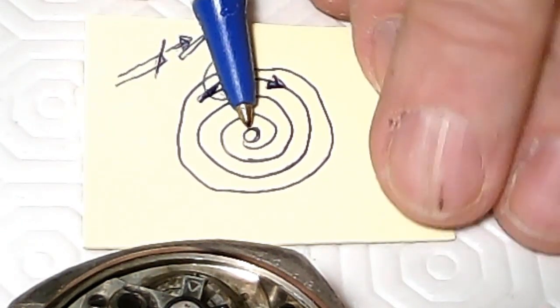I'm not going to do that right now in the video, but that's what I'll do, and that should hold this mainspring in place. So anyway, that's how to fix a mainspring problem, and again, it's filing it down. That should fix it without an issue, because it's slipping over the top of this notch, and the notch is low enough, so this is just slipping over the top, because maybe this is rounded or something, and the notch is just slightly below it, so it's going bang, like that, and it's spinning around that way.